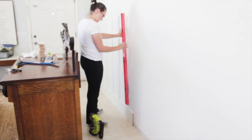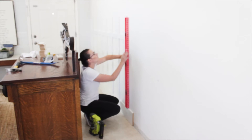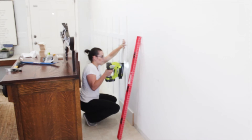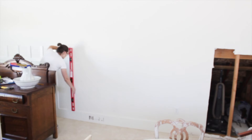I've sped it up and we've progressed quite a bit on the wall. Keep moving along — add one 49-inch slat, put a 9.5-inch piece in the middle using the penciled line across your wall, then add another 49-inch slat. If you get to the end of your wall and there's a little extra space or it's a bit shorter, just adjust the 9.5-inch piece longer or shorter according to the remaining wall length. These little imperfections will go unnoticeable and your entire wall will be filled with wainscoting.